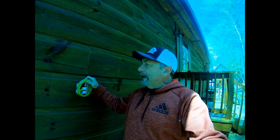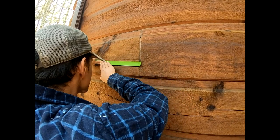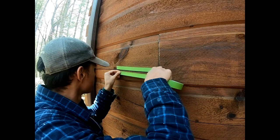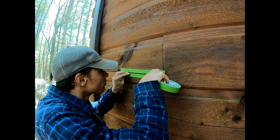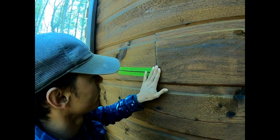This is scenario one with rough logs. A really important step here is taping off the checks — I recommend Frog Tape. It's a bit expensive, but it does a great job. Other painter's tape just doesn't stick well to rough logs. Tape along the top and bottom edge of each check. The tape is about three-quarters of an inch wide and you can bend it to follow the edge. I know it looks like you're wasting time, but this step saves so much time.